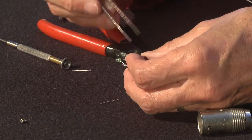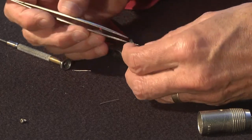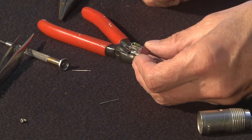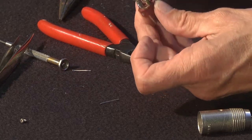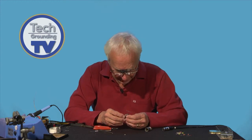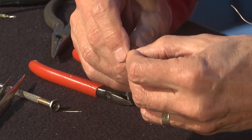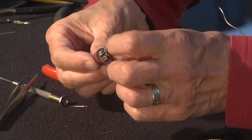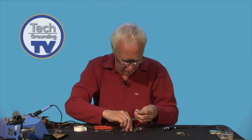It's all a bit agonizing. Now, this is not the sort of thing you'd expect from an electronics factory, but we're just making it for our own use, and if it works we should be happy. Ideally I should put a bit of tape around that — the inner ones aren't touching anything, but I'll put a bit of tape around the outside so it doesn't short to the shell of the XLR case.